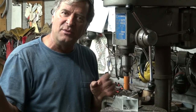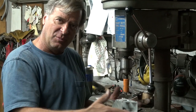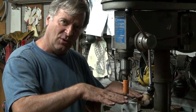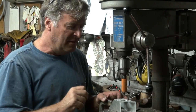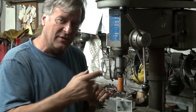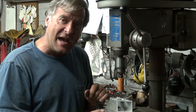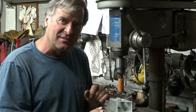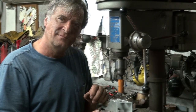On steel, I was using a little cutting fluid. On the drill press, I had a big chunk of wood clamped to the table, then my metal clamped to the wood to keep everything straight. You just go a little slower and easier. I've done quarter inch, and even a piece of half inch once with the drill press — it took a little while, but it got there. It's a fun little tool that helps when you just want to punch a hole without getting out the big saw or having all the cleanup. I'll see you guys next time.